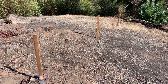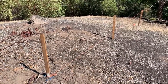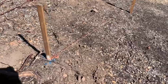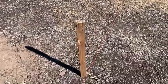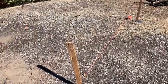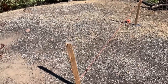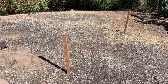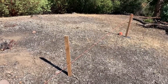It is day two and we roughed in the locations for the holes for our solar array yesterday, and now we're going to fine tune it a little bit. The first thing I did was run my string from point A to point B, and this middle one you can already see is off. It's good to have that settled up. Before I deal with that, I'm going to take this handy little tool, which is a line level, and see just how far off we are. If your measurements aren't taken at level, your final layout will be off in any number of different ways, so we're trying to avoid that.